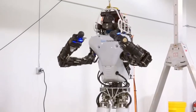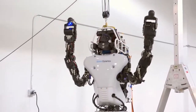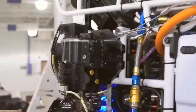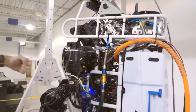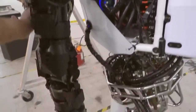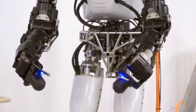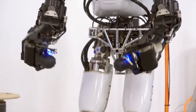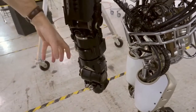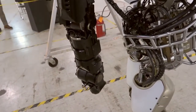The arms have been repositioned on this robot — basically the shoulders have been flipped over. You see the arms come out from much lower in the robot, and this allows the users to have more workspace in front of the robot so they can see what its hands are doing. We will have a new set of electric forearms which have a wrist degree of freedom, allowing them to turn door knobs without having to torque the whole arm.